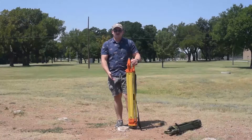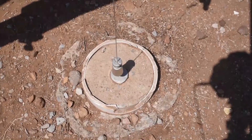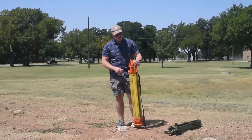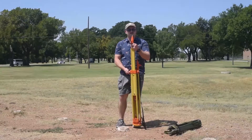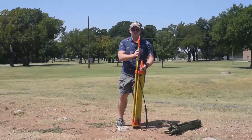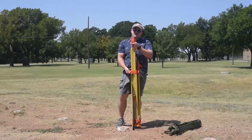I have a place that I'm going to get properly plumbed over — it's going to be either a hub in the deck or an SCP, something that I'm going to hang the plumb bob over. Now I'm going to take the tripod and erect the legs to about chin height. That's chin height for whoever is setting up and using the instrument. I'll bring them all out to the same distance.